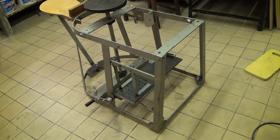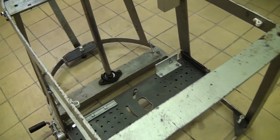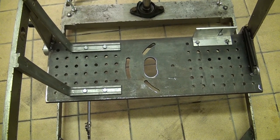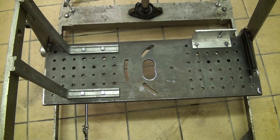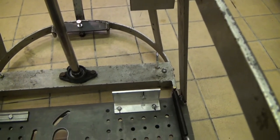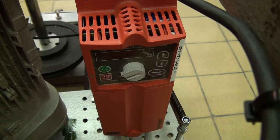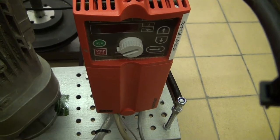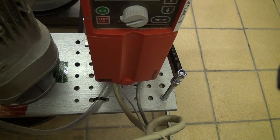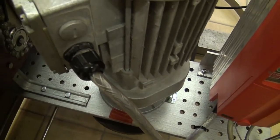I welded in a steel plate as a platform onto which to mount the new drive equipment. The radial slotted holes in the centre are to fix the new electric motor, allowing it to swivel forwards and backwards to slacken or tighten the drive belt. The electronic inverter will be secured to these aluminium brackets, top and bottom. Here is the inverter now fitted. This converts the 240-volt single-phase supply into 240-volt three-phase, so that with a potentiometer one can vary the speed of the motor.